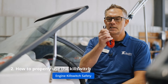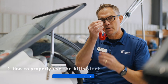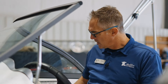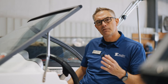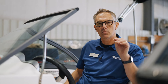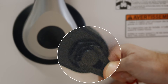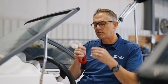This kill cord or emergency lanyard stop switch is not used very often and is usually seen just curled up beside your remote control on your boat. There are different variations — some are typically an on/off switch, which Mercury and Volvo have more commonly — and then there are others that have a little button where when you pull the cord out, the button goes in and that shuts off the engine.